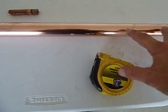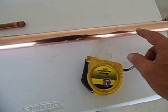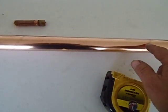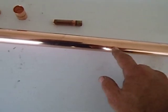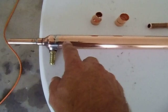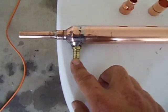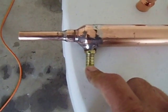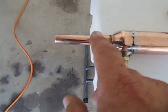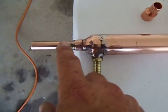As I said, there's about 4 pockets in there of 20mm, and it's got half inch reducers just to break the flow of the liquid as it goes in. It will sit in the pockets, fly over to the next one, sit in that pocket, fly over to the next — that's the whole idea of the 20mm into the half inch and then back into 20mm and then out. The water inlet is here, so the water is going to travel upwards, and this is going to be the outlet for the liquid — or the alcohol — to come out.